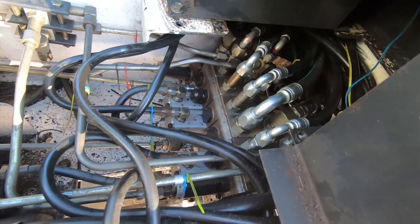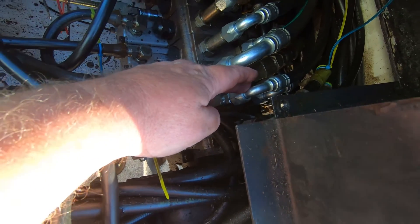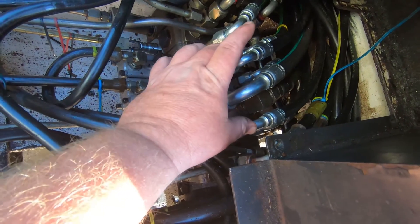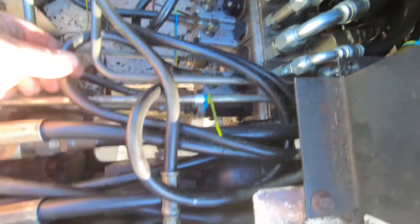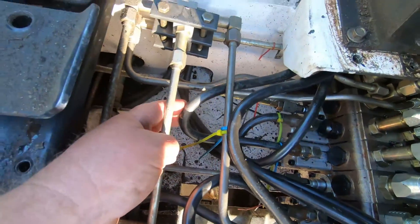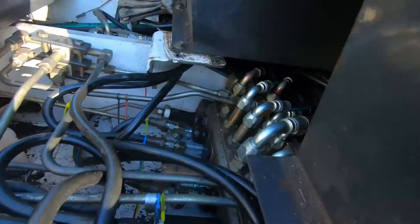We think we've got this figured out. It looks like this first spool here — there's one next to it — this one here is the lift; these are the lift hoses. And this is the crowd hoses. You can do this two ways: you could switch the big hoses across, but what we're going to do is switch the pilot lines — this line and this line here. There's a lot of slack here because it originally would have been over here, and this one's got a big U in it where it would have been over here. The back ones aren't as easy to get to but you can get to them down under there.